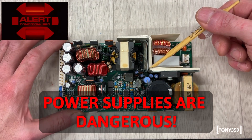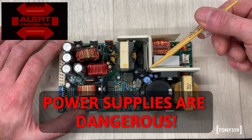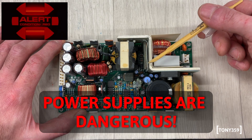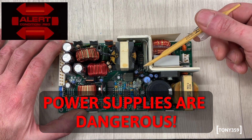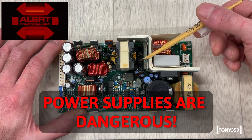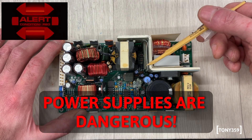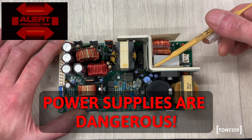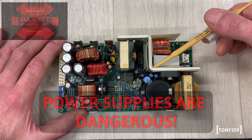This has been disconnected for months so I don't care too much about it. Also remember that you can't really use your oscilloscope on switching mode power supplies whenever mains is involved — unless you know what you're doing or unless you have a differential probe. If you ever decide to take a look at a switching mode power supply, you do that at your own risk.